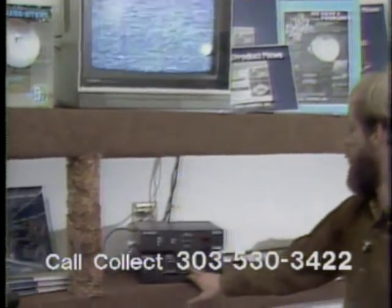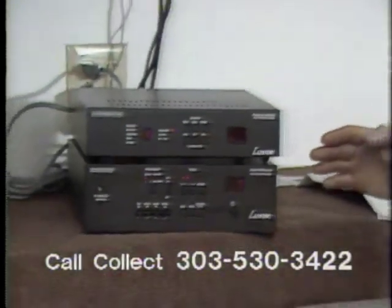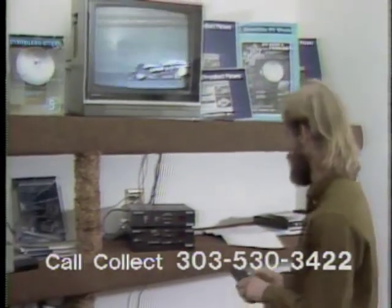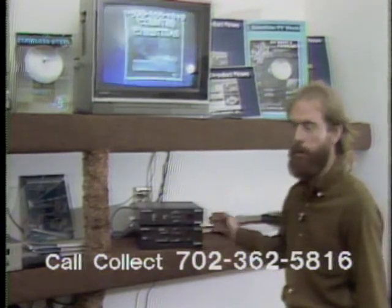Okay, locate where I am. I come up. The first channel I hit is channel 1, then I hit 3, then I hit 5, and then 7. Fine tune for my best picture and hit the store. You do this procedure for all of the even channels, or all of the odd channels. Then we dial up the even channels and do the exact same procedure for all of the even channels.